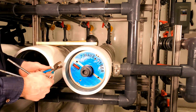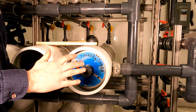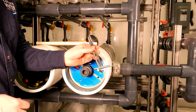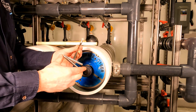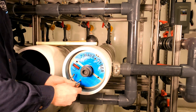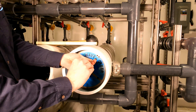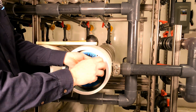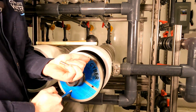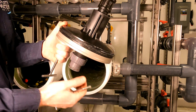Some people will use channel locks and try to pry back to get the end cap off, but I say that is not really a good way of doing it — you can actually cause damage, snap pieces, or what have you. You can use these T-handles. There will be a link in the description below for these T-handles; you can order them from us or from your RO housing manufacturer. They come in different sizes and variations. This one just threads in here, and you go ahead and pull on the T-handles — it'll pull out the whole end cap. You can then remove your T-handles.